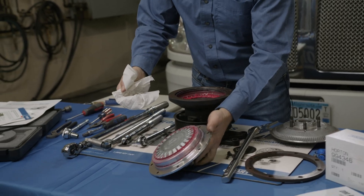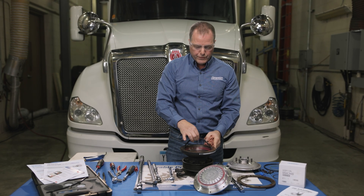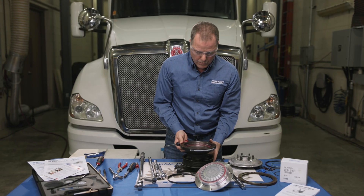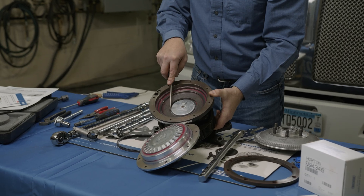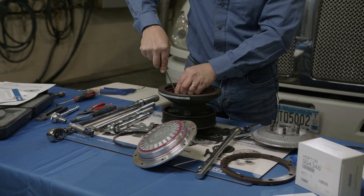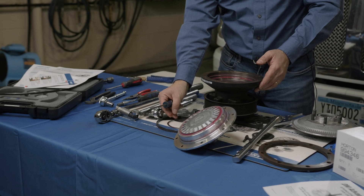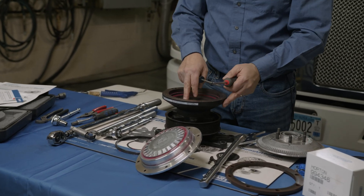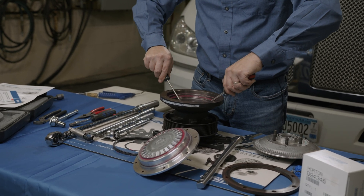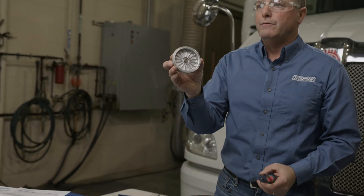Take some shop rags and clean up all the old grease off the clutch pack and out of the drive itself. After cleaning out the grease, remove the old quad seal. Then remove the snap ring holding in the air cap — there's a little lip on the snap ring that you can get underneath to walk it out. You do get a new snap ring in the kit. To remove the air cap, use two flat-head screwdrivers on either side to pry it up.